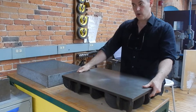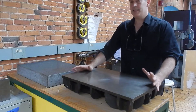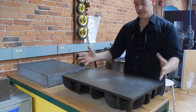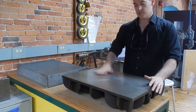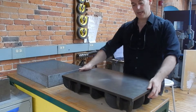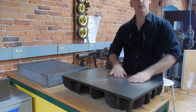The cast iron ones are a real feat of manufacture and craftsmanship, and it's worth examining them more closely. Older ones that are really well made are cast and then naturally aged — sometimes buried in the earth for a year, two years, or five years — so that the casting can stabilize and any movement that it wants to have is removed. Then the surface is put on it by hand, by rubbing with a master plate and grit in between. Because if you clamp this in a machine and machine the surface flat, you're introducing stress with the clamp, and when you unclamp it, that stress is released and it will no longer be flat.